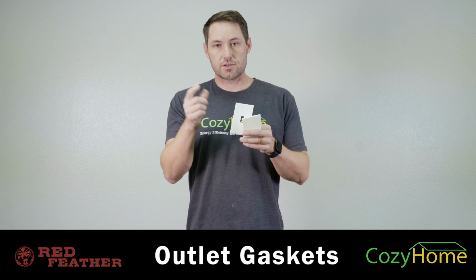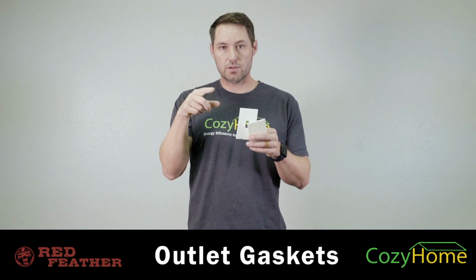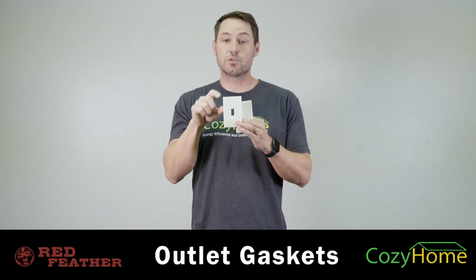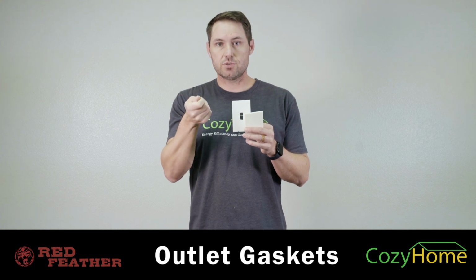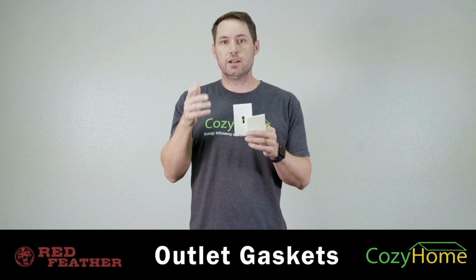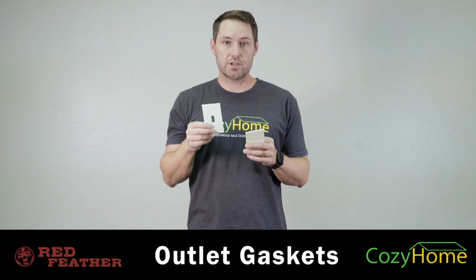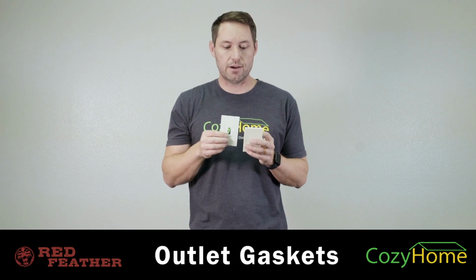All you have to do is take the screws out of the cover plate, which is a little plastic piece that goes around your light switch. Take the two screws out of it, put this behind it, and then put the two screws back in. You want to be careful once you have that cover plate out that you're not pushing the screwdriver back to where the wires are, but if you're careful, that's usually not a danger at all. If you want to be extra safe, you can always turn off the circuit breaker to whatever room you're working in, and that completely cuts the power to that room.